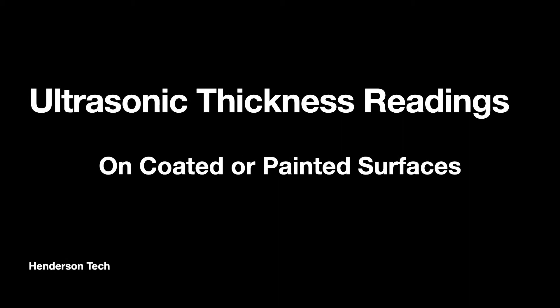This is a quick video explaining ultrasonic thickness readings under coated or painted surfaces. Paint is the most common everyday use, and it shows why when you take a multiple-echo technique — reading between two echoes instead of to the first back wall — you'll factor out the paint or coating on the metal and read just the metal. It's a really neat trick.